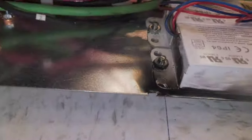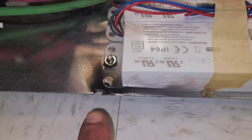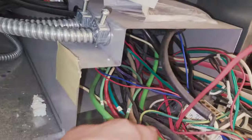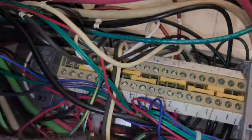I'm not really seeing very much other than that right there — very interesting. What caused that? That is a direct short to ground, caused by something at some point in time. I don't know if it's what's making my unit not work, but we'll find out. Based on this, that is not the cause, and I'll tell you why: we've got power going in and out of this breaker. This breaker feeds both circuits, both compressors, and the left compressor is working.